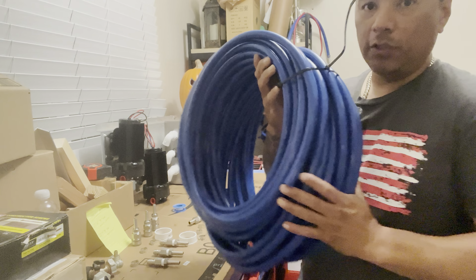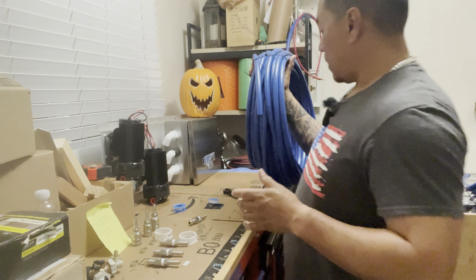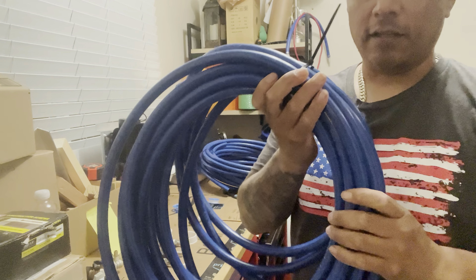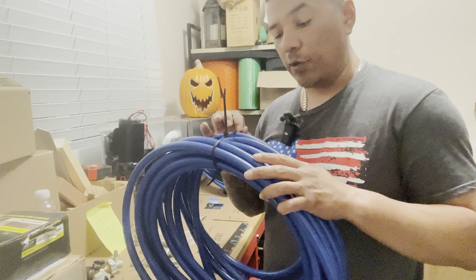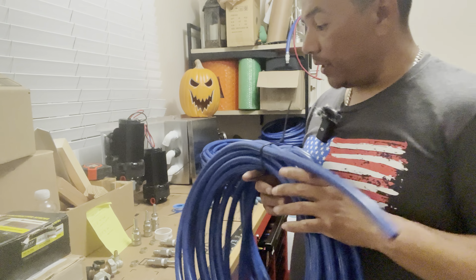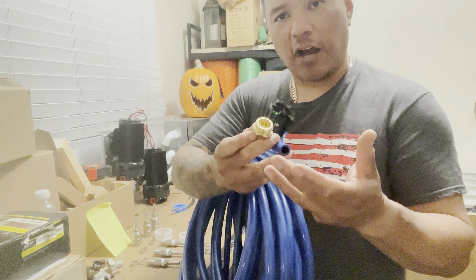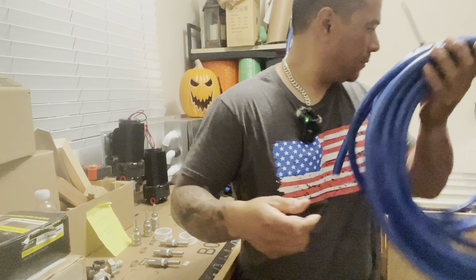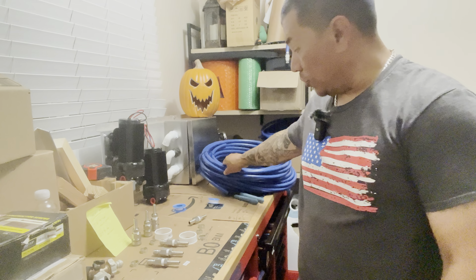I've got a 100-foot, 300 PSI blue hose here — three-eighths ID. He has two 100-foot hoses and two 50-foot hoses that he wants. One of these hoses — either a 50-foot or a 100-foot — is going to be your leading hose, meaning the very first end is going to be your garden hose male adapter. This is where your connection, whatever type of valve you use to hook up your water-fed pole line, is going to attach. Mr. Steven Pete chose to go with a 100-foot as his leading hose.